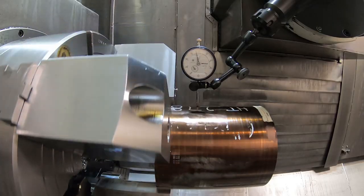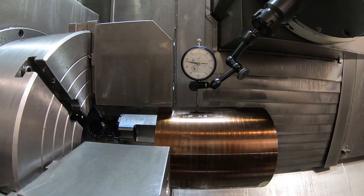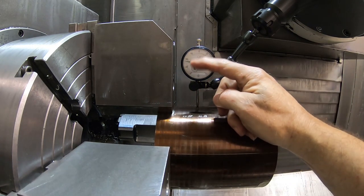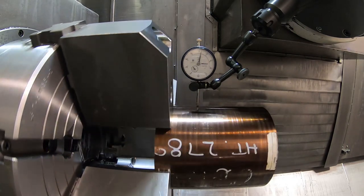So again, check the jaw 180 degrees from that jaw. It's got to come up just a little bit. But see, because I backed this jaw and the other jaw over here off a little bit, we're a lot closer. I'm going to come about half that to zero, and then I'm going to re-zero the indicator by moving the x-axis, and check that jaw